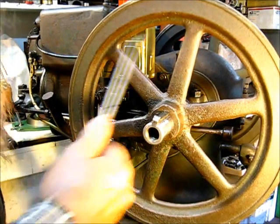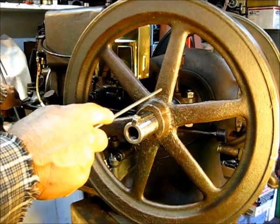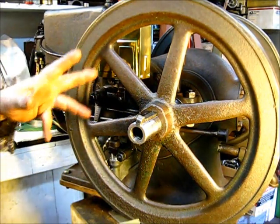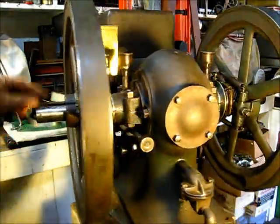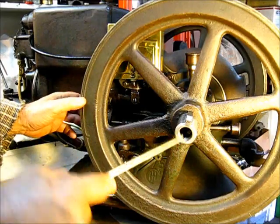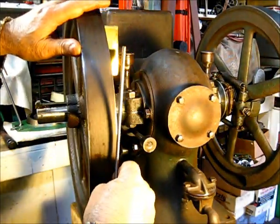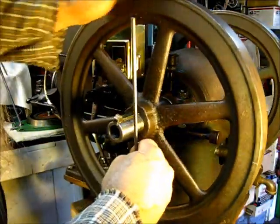It's just not a good idea — that's the nature of cast iron. This is not a metallurgical video by any means, just some observations through the years. I think you could bend this flywheel a quarter of an inch out of square and it would stress the metal to the point where it didn't break — still intact. But if you've got one that's out of alignment, the problems are in these spokes right here. It's heat transfer between the spokes, and back in those days the casting wasn't that good. To straighten it if it was a quarter inch out, when you push it back you have to come past that quarter inch — you'd have to move the flywheel at least a half inch to account for the spring-back action.